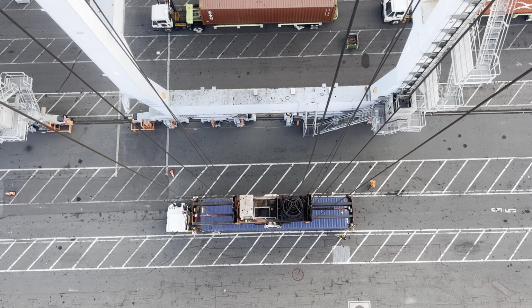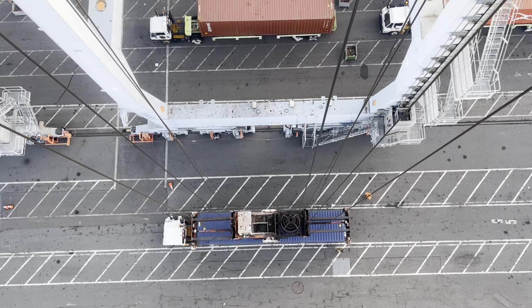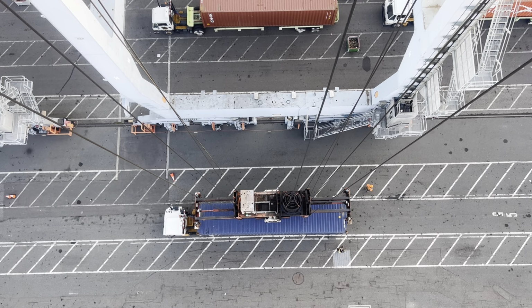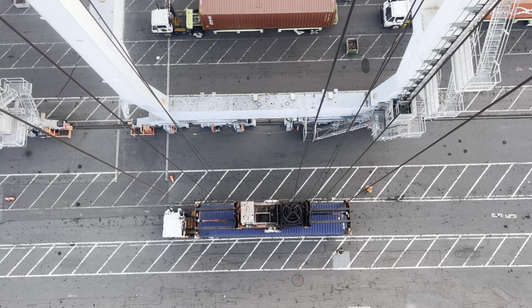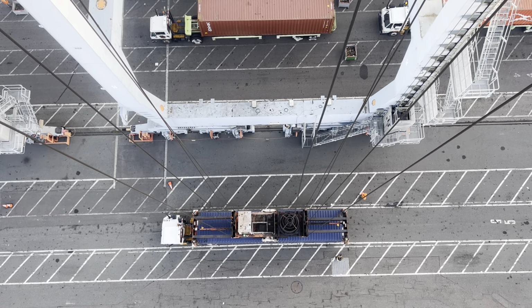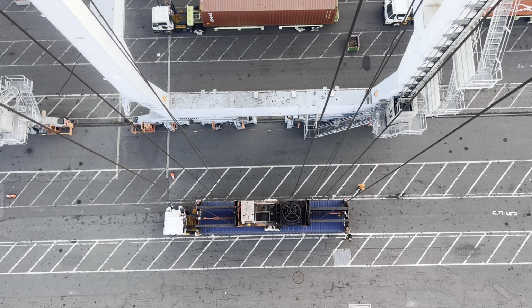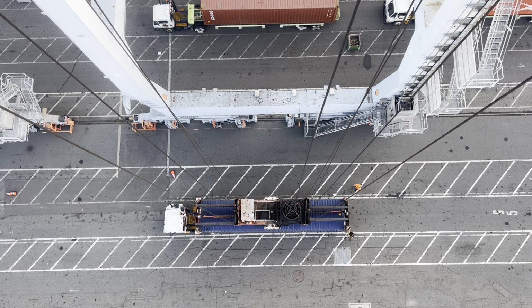If you are a new crane driver, remember if you're picking up off of a chassis, you wanna take your time when you go to lift. You wanna make sure it's clear. So we already know we got cones on the front of the can. They have to put cones on the back. So I'm gonna pick up real easy here. Get that back in the lift up.